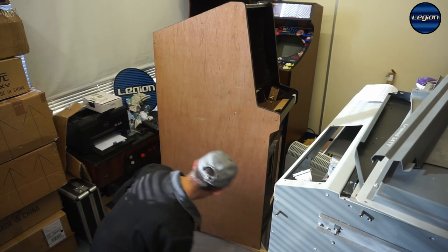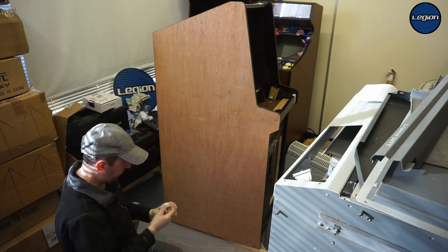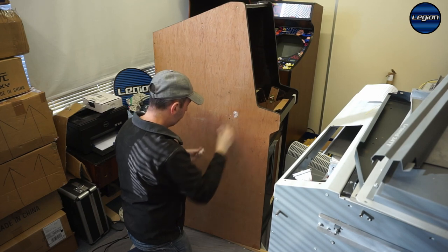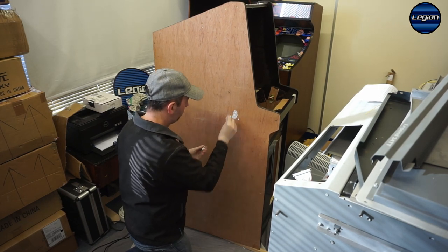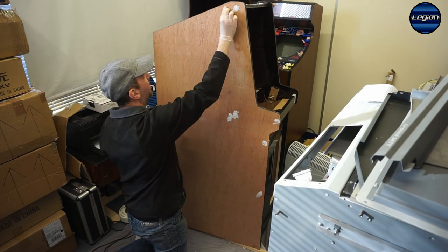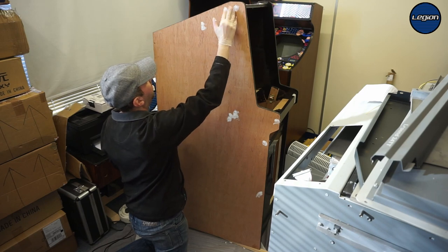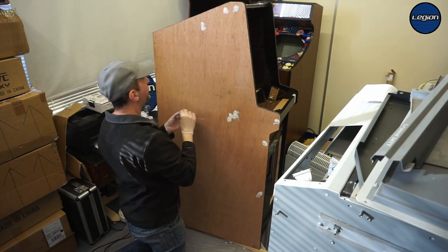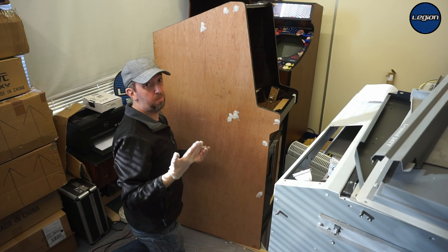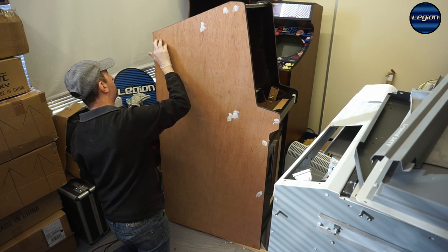Okay, that's loads better. So now we have our wood filler and I'm just going to work it in with my fingers. I've been quite generous with it. I found if you try to put it in and then work it flat, it kind of pulls itself out of the hole and you end up still with an indent.